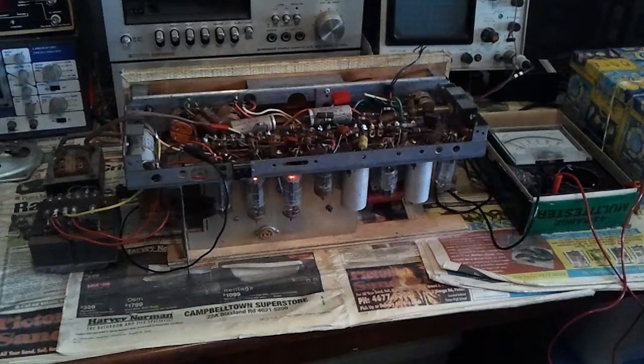And that way you can bring the voltage up on the circuit slowly and start to see if things become amiss. Obviously from a servicing point of view, if it was somebody else's radio, you'd almost just replace all of the paper capacitors and electrolytics to start off with, and that would give it some future reliability.